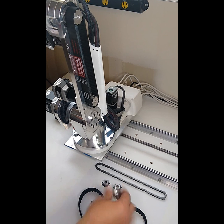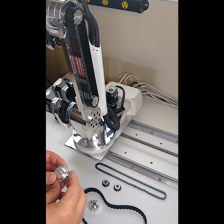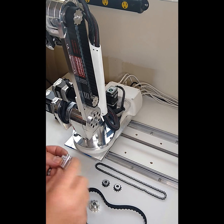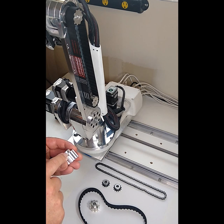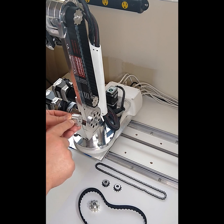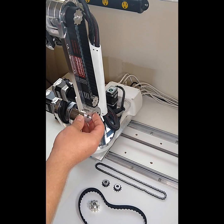So what I've got here is a custom designed pulley. This is an L-series 10-tooth pulley. The shoulder protrudes out the end, and then the set screw is in one of the grooves here so that while it's installed, it can get far enough onto that shaft, but you can still access and tighten the set screw on it.